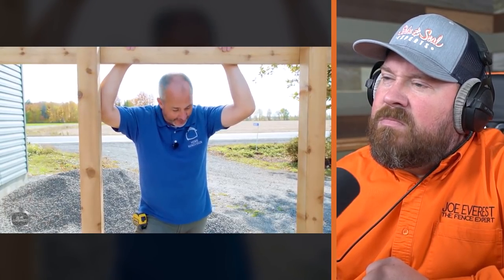This is going to be more of a windbreaker than anything else. You've got options — you can go with different varieties of boards, thinner at the top, have a little fun with the design. As long as you stick to outside miters, gluing the boards on with galvanized brad nails, you're going to be just fine. When you get near the top, you want to cut all the posts at the same height so you can install post caps.